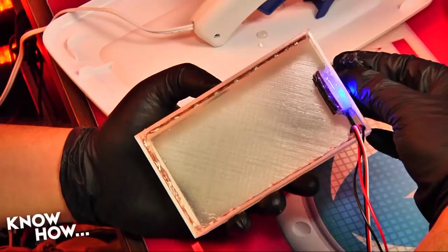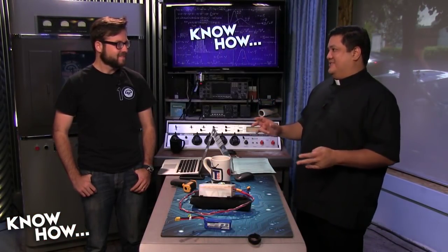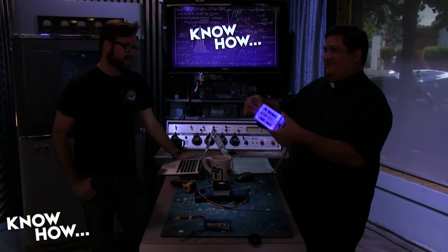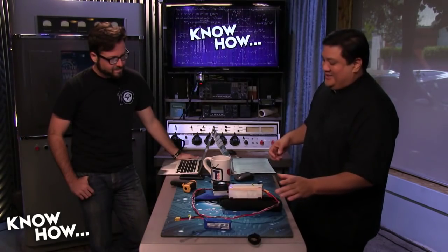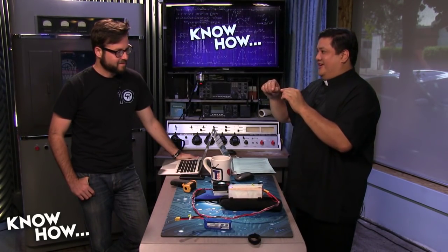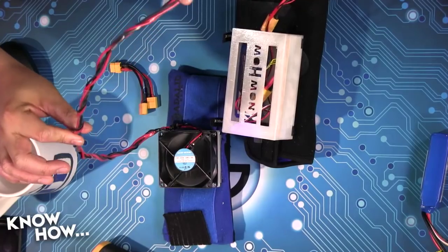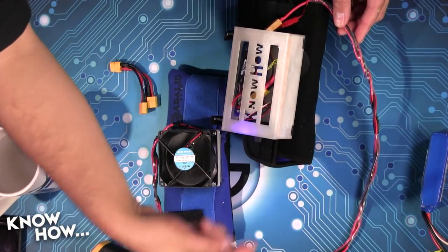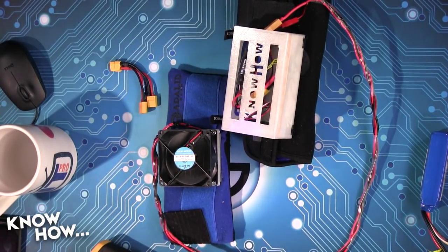Once again, we could have stopped there, but what would be the fun in that? That light isn't just because I like LED lights — it's also because I needed a way to know how much power was flowing into the Peltier. It's a very visual representation: the brighter it gets, the more power is going into the Peltier, because it's directly tied into the side of the electronic speed controller that feeds the Peltier. The added benefit is it looks cool. I also wanted to get some electroluminescent wire and run it in the harness — I've used clear heat-shrink tubing to keep it bound up. I wanted to put some EL in there so that as you lit it up, the EL would start to glow. I'll save that for the next version.